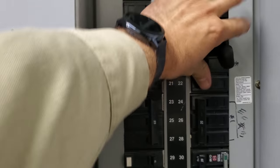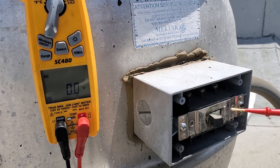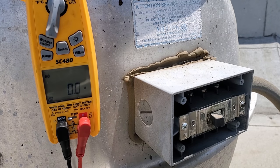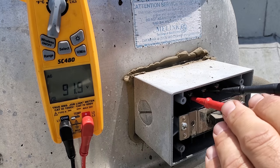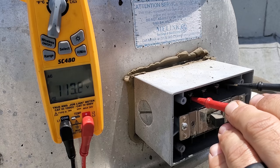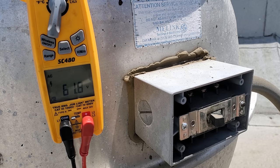It's a tripped breaker — breakers 18, 20, and 22. We're going to turn it off, then turn it on, and go upstairs to troubleshoot. Now that we reset it, I shut the switch off, and I will tell you — when I shut this switch off, it didn't feel right, the actuation felt funky. But we're going to test incoming voltage coming into the switch. One to two we get 202 volts, one to three we get 200 volts, and two to three we get 200 volts.